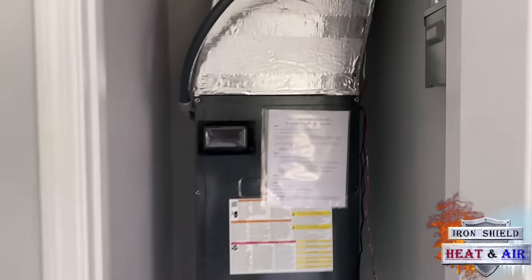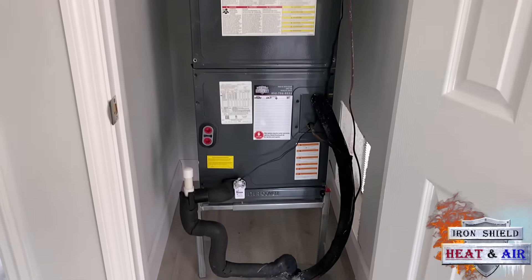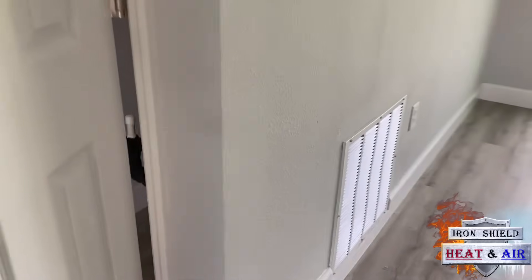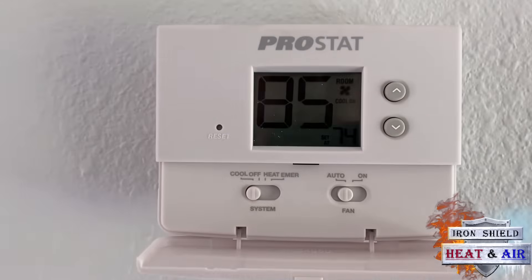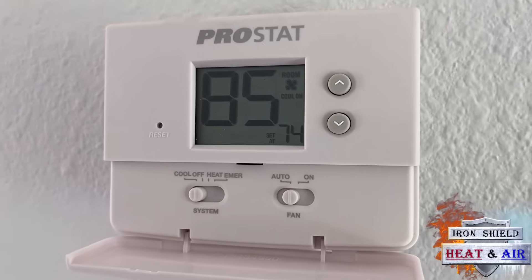This is a Mercedes model. It's in a closet, a rather smaller house, two-ton air handler. It's got a free draw with the filter down below — we'll check that, pull it out, make sure it's clean. Free draw, direct return. It's like a 20 by 20 step grill. A Pro-Stat thermostat on the wall. It is set to cooling. It's 85 degrees in here, set to 74. The fan's running, it's calling for cooling.